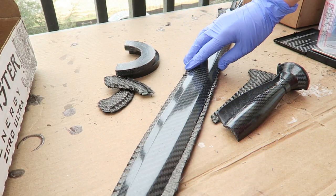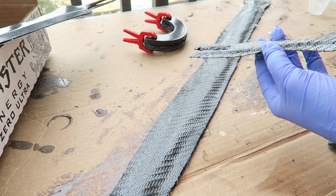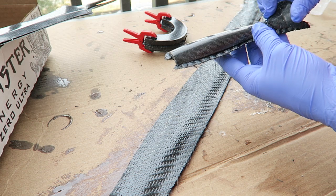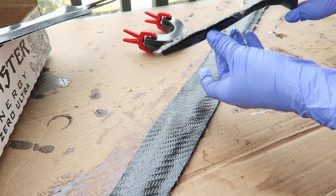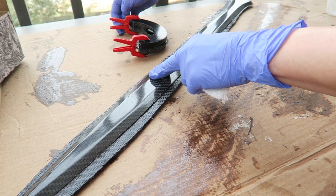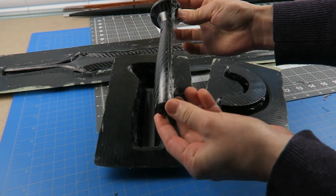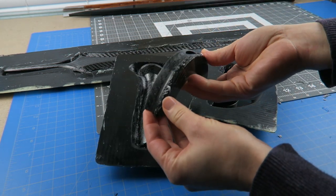To attach the halves for each of the parts, I've created a centerpiece from a sandwich of carbon fiber with a thin sheet of foam in the center so that it doesn't droop down into the parts — we want it to stay flat while the parts are curing. That gets wetted out with resin and each of the parts placed so that they align across that center sheet. I first tried clamping the parts but there was too much shifting, so I ended up placing them back into the molds so that one half would be held stable and then the other half could be weighted down from above so that there would be good bonding between the two halves.